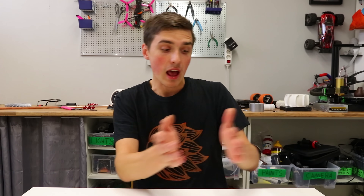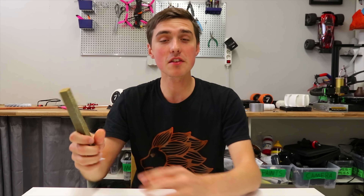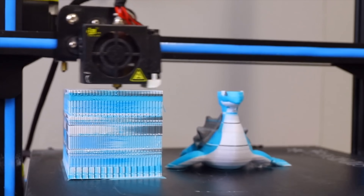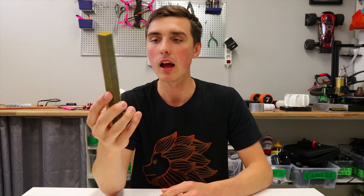You wouldn't be able to make this video without mentioning the Palette 2, coming out soon. The Palette is a system that makes basically any 3D printer multi-extrusion compatible. All three systems have their own set of problems. The Palette 2 can do four colors at once, but the calibration was quite a challenge, and instead of a pillar of wasted plastic, it uses a tower — significantly more wasted plastic than any other system. It will also be slower because it has to print a lot more plastic. They are working on solutions for this.